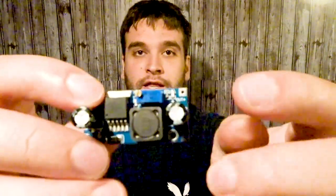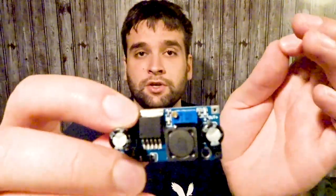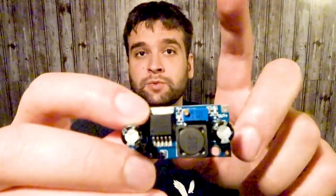This little buck converter works very well. You just literally hook this thing up — these are all the pads, so you solder the wires on here, and then you solder the output wires here. This little pot right here allows you to adjust the voltage being produced. That controls the output. In order to control the output, you also have to hook up a multimeter and get the voltage that way.